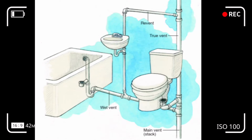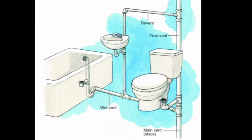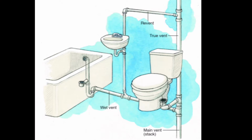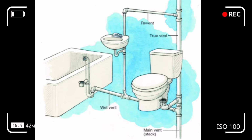When a plumbing system layout plan is being developed as shown, depending on your setup, you can choose from several venting types, but each option could present problems or complications. That's why it's important that before finalizing a plan like this, you have the venting scheme approved by a local plumbing inspector. So you can pretty much see where the true vent is located. It's a vertical pipe attached to a drain line that travels through the roof with no water running through it. But bear in mind that many fixtures are not so conveniently located. If it's not conveniently located, other solutions must be found, okay?